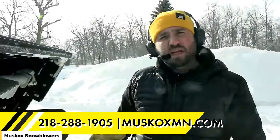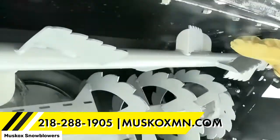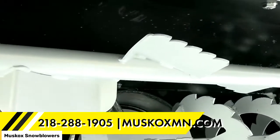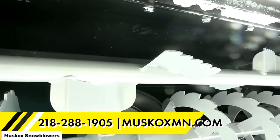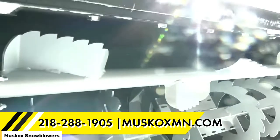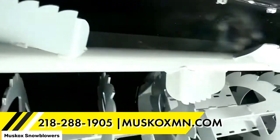Then for that second part of the question, you notice that we have a slightly different design for our second auger that's on top on our dual. And we use a paddle design. The reason we do that is we found that was the best when we're in our back drag and blow position. So we're getting close to that surface, riding on our rubber cutting edge, that paddle most efficiently paddles that snow into our blower motor and out through our chute.